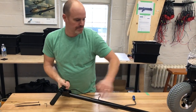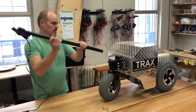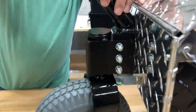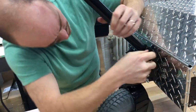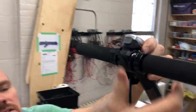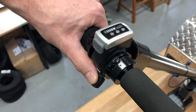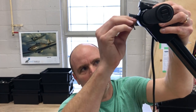Now that the two set screws are nice and tight, your handle is secure. Pick up the handle, remove the pin, drop the handle in the socket. We didn't tighten the thumb throttle yet because it'll rotate — you want it on an angle. You may need to play with it a little bit so that when you push it down while operating the dolly you're comfortable with it. We're gonna use the two and a half millimeter Allen wrench and snug it up. Be careful — the body is plastic and the screws are steel, so don't crank it hard or you'll break the plastic, just get it snug so it doesn't want to move.